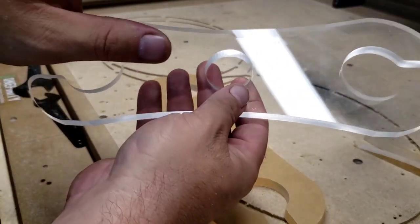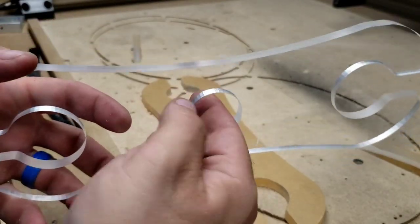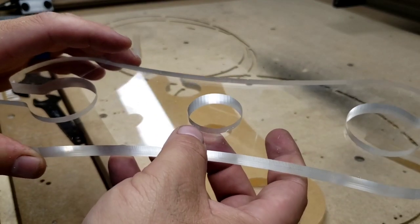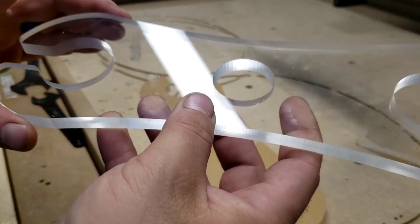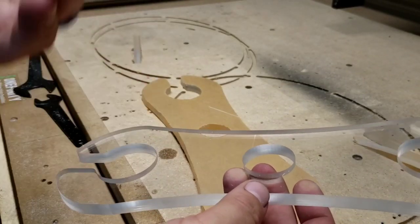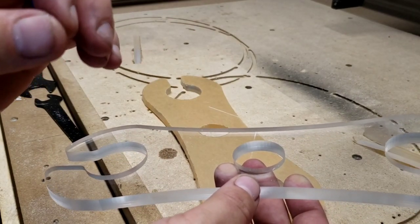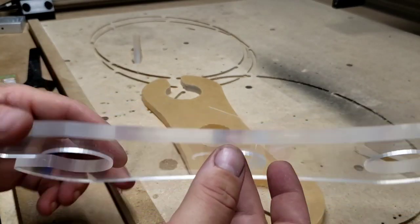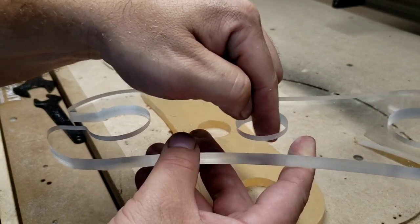Now, like I said before, you can use a router table with this. You can use just a router, a palm router, or if you want a plunge router, that works too. And doing the outside, you use the flush mount trim bit. And if you're doing it the opposite direction, I don't know exactly what they're called, but the bearings on the other side, it's between the shaft and the actual blades, the flutes. So doing that, you can plunge down and have the bearing hit on the inside and cut out a depth